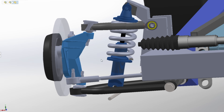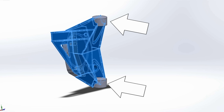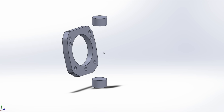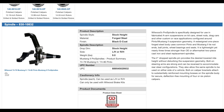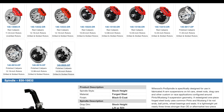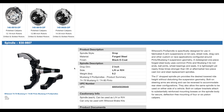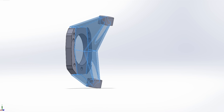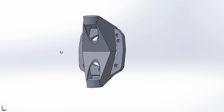So here's my basic design. I need two parts that bolt to the ball joints, in the same location as the spindle ball joint mounts, and I also need the part that bolts to the hub — this puts the wheel in the same spot as the spindle. It's pretty common on this suspension setup to use a two-inch drop on the spindles to help get the car lower. I didn't have that on my spindles, but I'm adding it to the upright so I can get the front of the car a bit lower. The third part of this upright is the sheet metal that connects the ball joint parts to the hub parts and makes it all one piece.